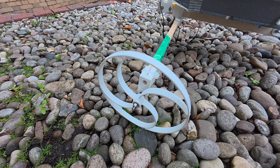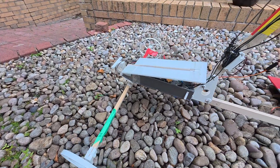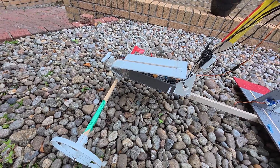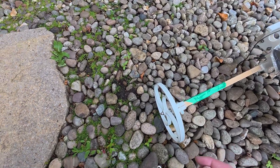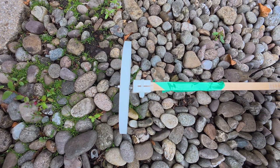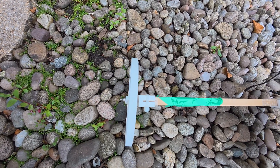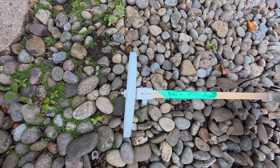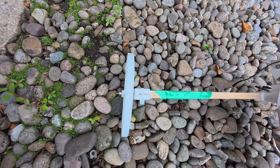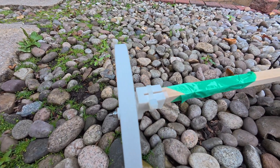Slight changes to the landing gear. I've had trouble with the thing veering off on takeoff, which is down to trim — maybe not enough rotor speed — but something that does help is actually toeing in the landing gear. It's probably not particularly visible on the camera, but it's angled inwards with respect to the forwards direction, which is stabilising. It adds a little bit of drag as well, but I'll put the mounts up with toe-in.